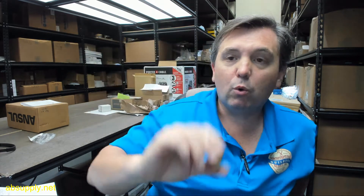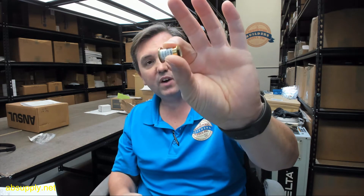It would be required that all of your hardware be UL listed as well on a door that's fire rated. This is compliant with that. But there are no fire rated doors that are 1 inch thick. Obviously you have an inch-and-three-quarter thick door that has a panel design, and you might drill a hole through your panel with a standard viewer and then realize the thickness of the panel is far thinner than the thickness of the door, which is typical and common. Enter the 975-1.